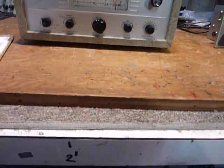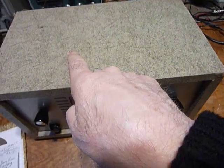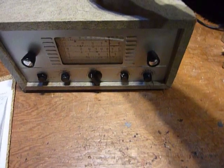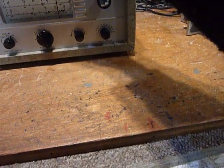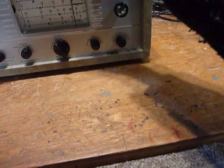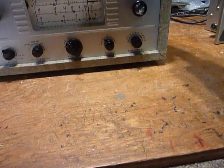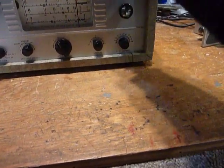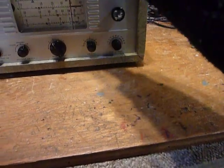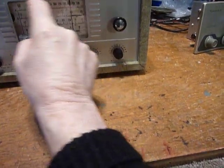When you align one of these things you may get a little confused with the coils at the top — there are three rows of coils. The first row on the left is the A band, which is broadcast. The second row is the B band, which is one point five to four megahertz. The third row on the right-hand side of the coil mounting plate is the four to eleven megahertz band. In the back you've got the oscillator coils. In the middle there are three capacitors used for band spreading, to make the band you're tuning wider or narrower to match up with the marks on the dial, and usually that doesn't need much adjustment.